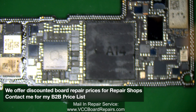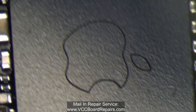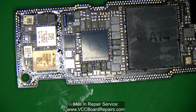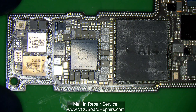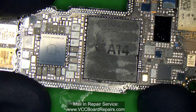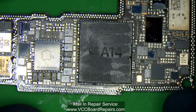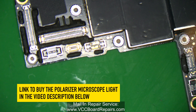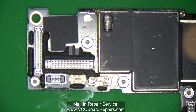Now, one of the things about that synchronization I showed you — once you put the board at a different height, that whole thing gets messed up. So I zoom in, everything's blurry, I focus it, zoom out and it's no longer in focus — it's pretty blurry on the eyepieces, though the camera is not that bad. That's why I said set the synchronization at the most common height you work at. Every once in a while you have to work at a different height, which will affect that. By the way, it's actually called parfocaling your microscope — I think more people would understand if I just say synchronize. Also, I'm using a polarizer light, which is really bright and also improves the quality of the image. The brighter the light, the better the microscope image you'll get.